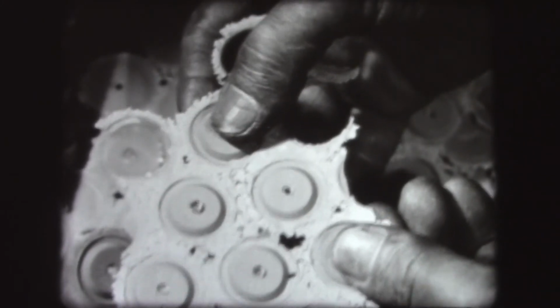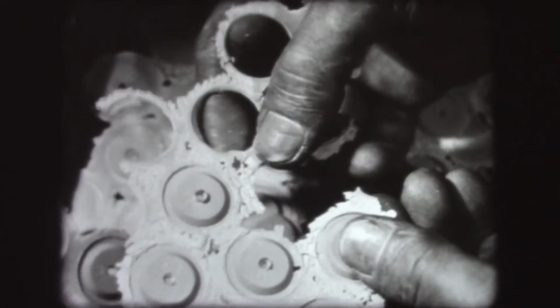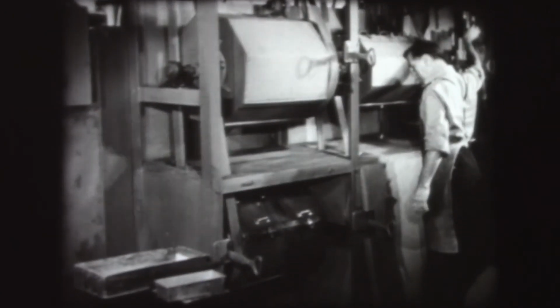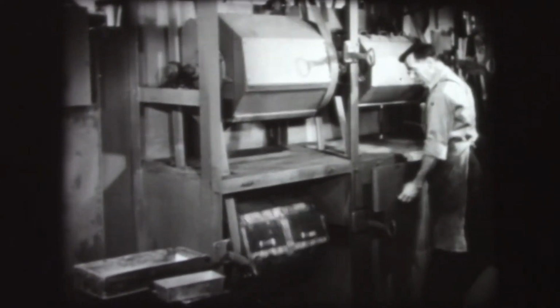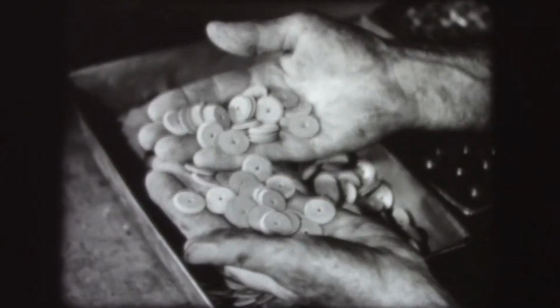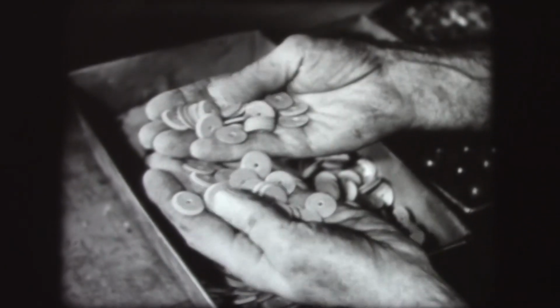Small pieces that are not easily breakable are often finished in batches by a process known as tumbling. For flash removal, steel shot is placed in a wire tumbling barrel. The molded pieces are then put in. The barrel is turned at a predetermined speed, in this case 65 revolutions per minute. The rotating motion of the barrel rubs the pieces against one another and against the metal shot, gradually removing the flash. With the flash removed, the pieces are ready for the polishing process.